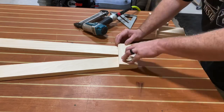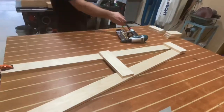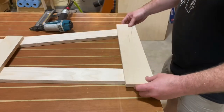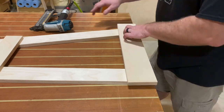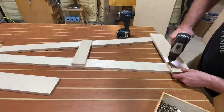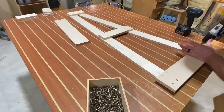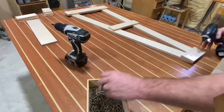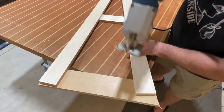I'm actually going to offset this A-frame. I'm using the lines in my work table here to give me the measurements I need — everything's being done by eye. I've got a speed square, making sure things are square and perpendicular, and as you see the A-frame is taking shape. This structure is going to consist of three of these. I'm going to make sure I build two of them identically, and then the third will be built in a mirrored image because I want the two outside facings to be identical.